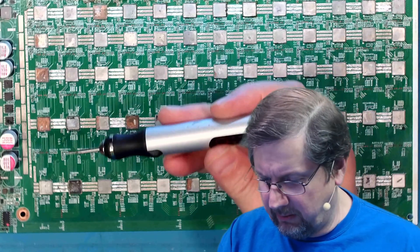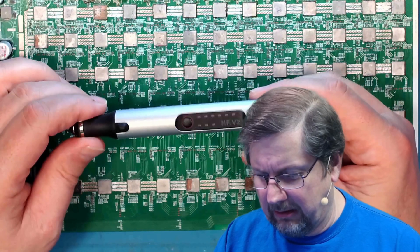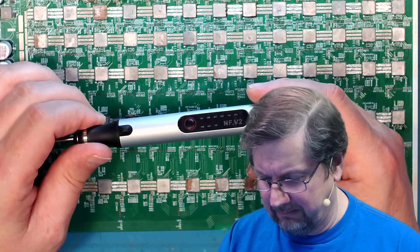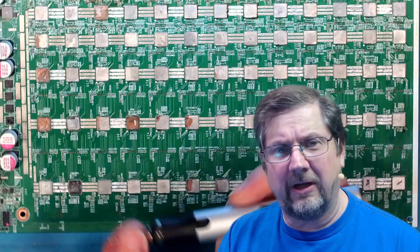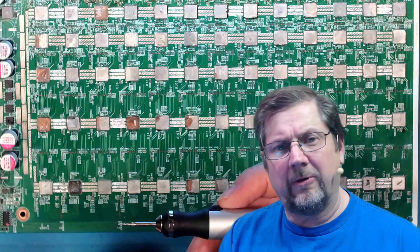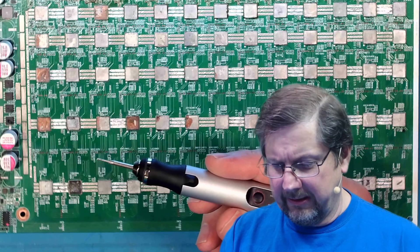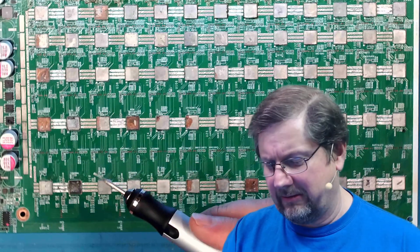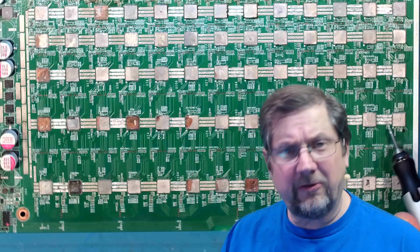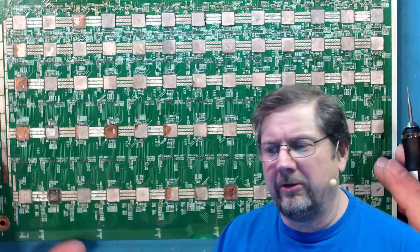For this next part I'm using a little USB-powered grinder with a tip. This particular model you can find on Amazon for less than 40 bucks, like 30 bucks even. The tips seem to hold up well and it recharges fast — I just can't seem to find the right replacement tips on Amazon. What I'm going to do is go back through all these spots where I took the solder off and take the solder mask off. If you don't have one of these, you could do it with an X-Acto knife, just taking your time. I'm going under the microscope to show you.